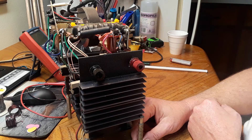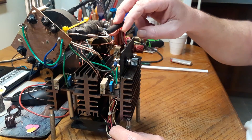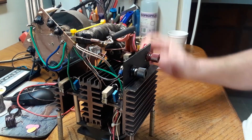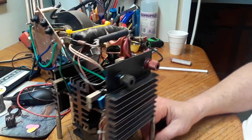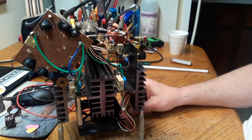It can accommodate more transistors in push-pull instead of just two. It has a 100 ohm bias resistor and a 10 ohm resistor to ground off the base drive windings, and 15 microhenrys on the B-plus choke. It does pretty well.